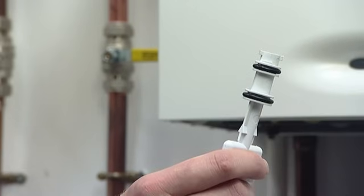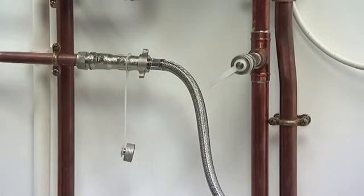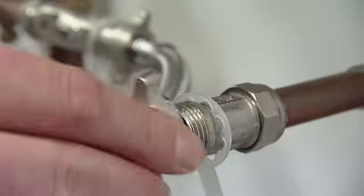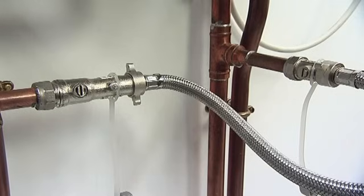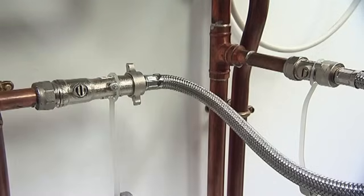The first method is the internal filling key, the second is the external filling hose. Firstly, make sure that both ends of the hose are securely attached to both of the valves. The hose should be located close to the boiler and in most cases normally beneath the kitchen sink. Before we begin to re-pressurise the boiler, make sure that your boiler is actually switched off. Depending on how the installer has chosen to install the filling hose, there may be a valve at either end, or a valve at only one end.